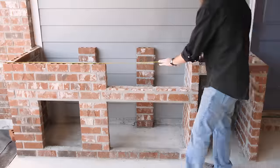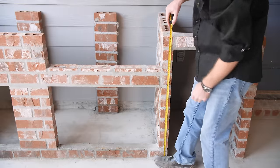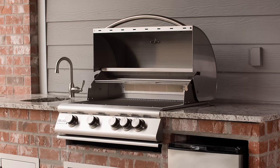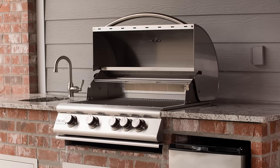In the Watson's case, we recommended that they went with a structure that was 8 feet wide and 36 inches high, along with the standard measurements of 30 inches deep, allowing for proper lid clearance to this non-combustible hardy plank wall. Safety tip here: for combustible back walls, always check your grill's owner's manual for proper clearance.